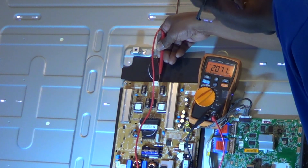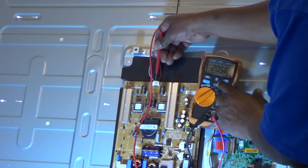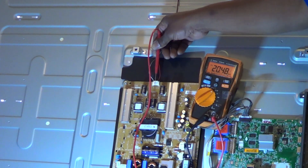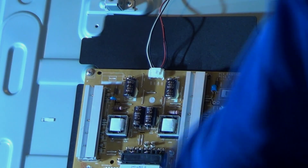That's what we should have on each line. We'll check our return voltage on the negative wire — the black wires. That's our return voltage: 20 volts. And 20 volts on both lines. That means all the LEDs are pretty much good.